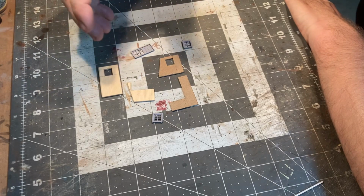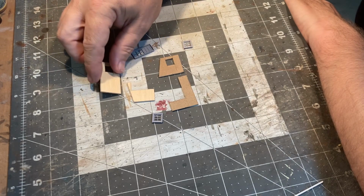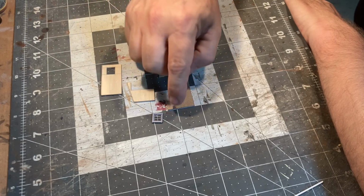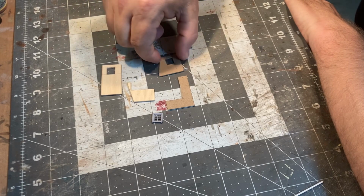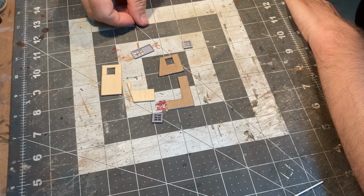And now we are going to add the corner boards. We'll add some bracing to the back to keep them flat. We'll do some of the paneling on the front here, and the sidewall shingles on this end wall. And once all that's together, they'll be ready for paint and assembly. So let's get started on that.